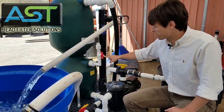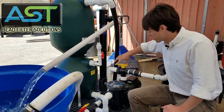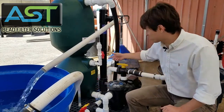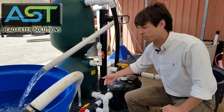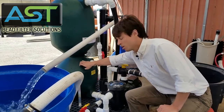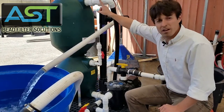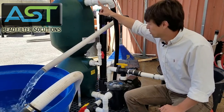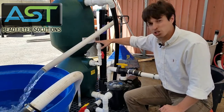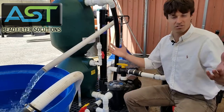With this small valve being open, I'm going to turn this valve first 180 degrees, then I'm going to turn this valve second. What that's going to do is change the flow — instead of pulling water from this tank here, it's going to start pulling water through the bottom of the bead filter, pulling that water down. A one-way valve is going to close here, and this one-way valve is going to open. There's going to be a really strong air intake right here because of this vigorous drain. Alright, let's do it.